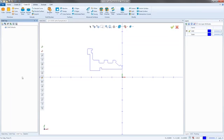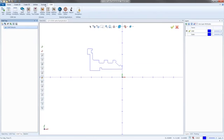I'm just going to go down to my CAM tree, right click on CAM defaults and say New Job. Remember with 31, there's a CAM tab now too. So if you didn't want to go over here and click New Job or right click and hit New Job, there's that option there. There's also this little icon right here, just under the word CAM in my CAM tree here. It's a little icon that lets me start a new CAM job.